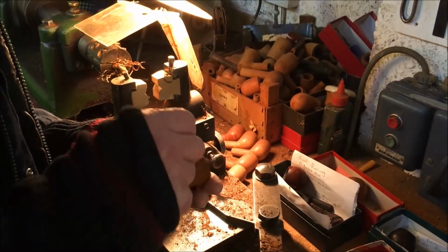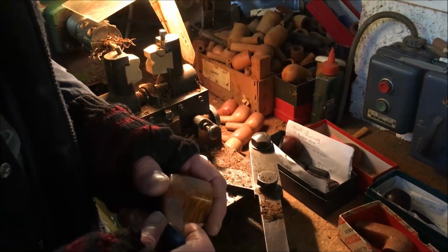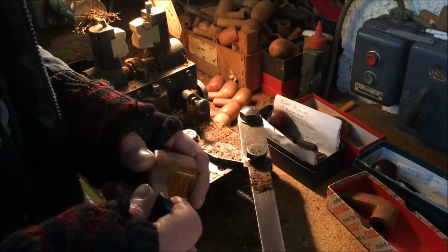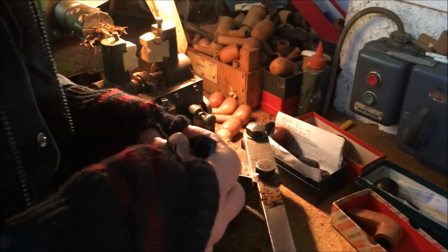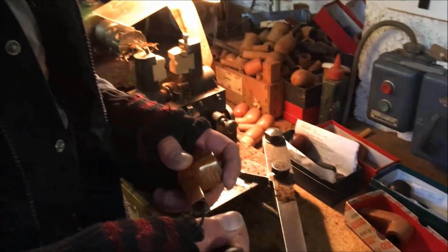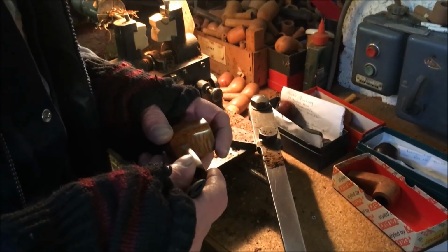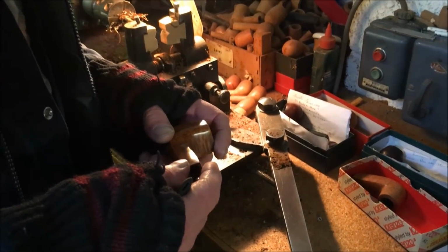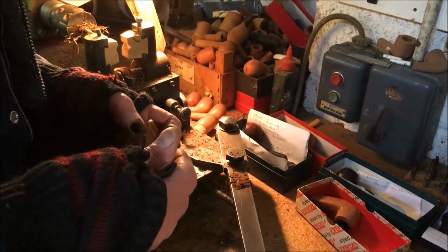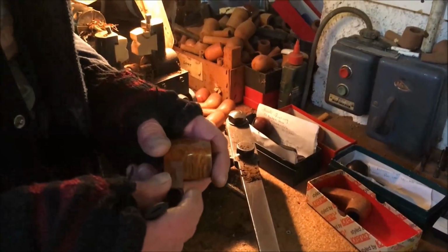Have you got a sanding machine of some sort? Or do you do it all by hand? It's not all by hand, though. I used a disc attached to a drill, with the Velcro things. And I just went through a lot of different grades of grit. I started off at around 60 or 80, went to 120, then to 500, 600, 1,000, 1,200, and 1,500. Well, I only start at 180 and end up on 400, don't go any finer than that. Right. Yeah.